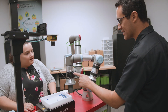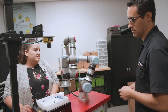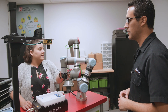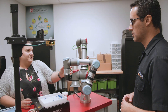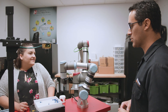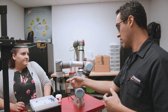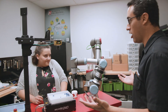I noticed this doesn't have a cord strung all the way back — it plugs right into the wrist. With all the E-series robots, you're now able to plug your tool directly into this area right here. Most grippers are now coming out with ways to connect directly, so you don't have all the wires coming out. We use vacuum cups, so that's not an option for us, but with a plug-and-play gripper we could just plug in and go.